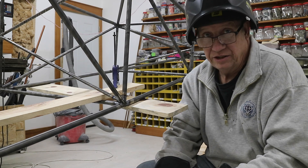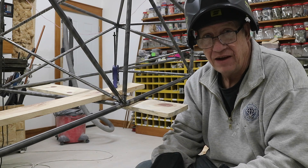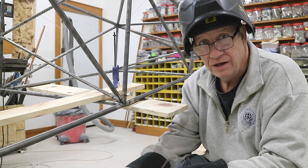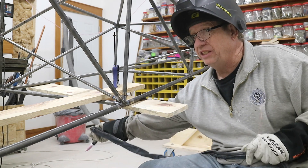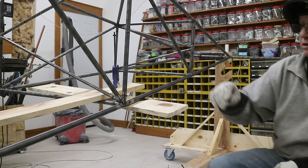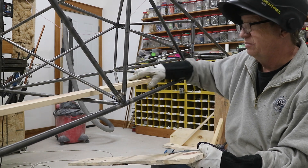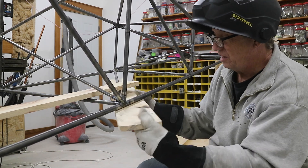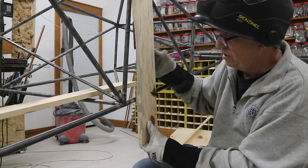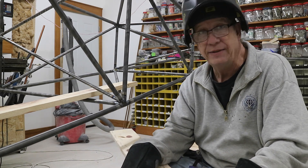I'm making some progress on welding these clusters. And if there's one thing I've learned, it's that I don't weld anything if I can't get both my hands - with the filler and the torch - on something solid that's comfortable to support them. What I've come up with is just a couple pieces of pine. I've just got a quick clamp, and it needs to be a quick clamp because you only have one hand to work with. By putting one crossways in the fuselage there, I can move this guy around to wherever I want, clamp it, move it to this face, and always have a hand rest. The quality of my welds has gone up probably tenfold by doing that.